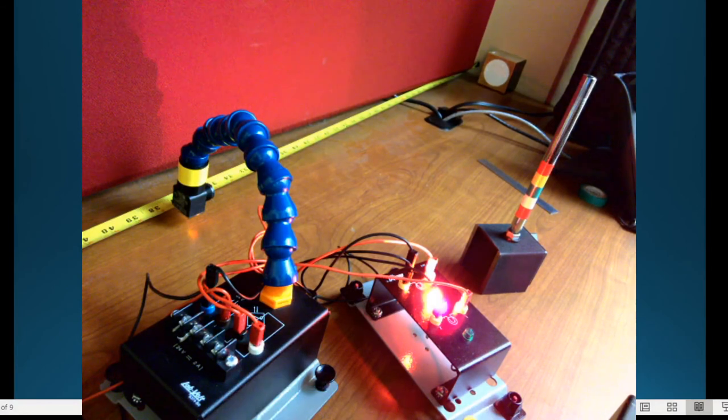So the nice thing about this is the distance. You can have up to 3 meters, and that's why you oftentimes see them at door entries. You know, it's wide enough. It's not that little 4-inch gap there. So this is the polarized version of that. There's also a non-polarized version as well, but the non-polarized version can have some false positives with it, so that's why the retroreflective is a little bit more popular.